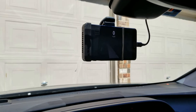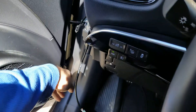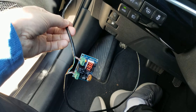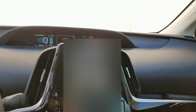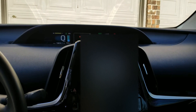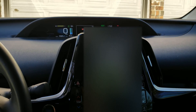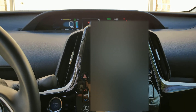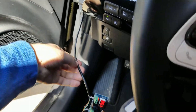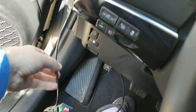My Eon is right now a little bit ghetto in a halfway state. What I'll do is package all this up nicely in an SLA 3D printed enclosure and set the values to something reasonable. The actual voltage disconnect will be something around maybe 11.2 or 11.3 volts, and the reconnect hysteresis will be like 0.5 or 0.6 volts higher. You guys can always change it to whatever you want. I'll make a notation somewhere for each module indicating what discrepancy I found — like this one is a 0.4 volt discrepancy. Thanks for watching.